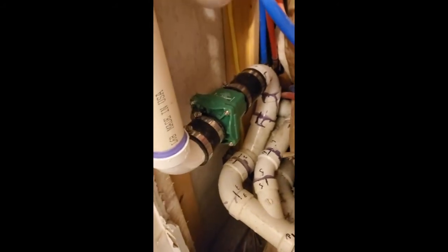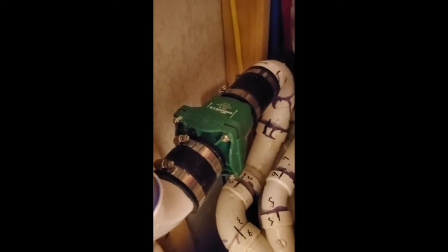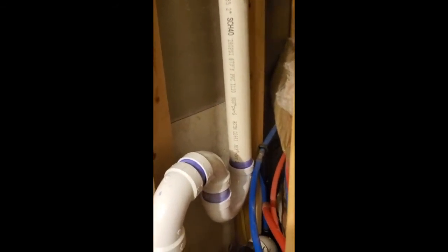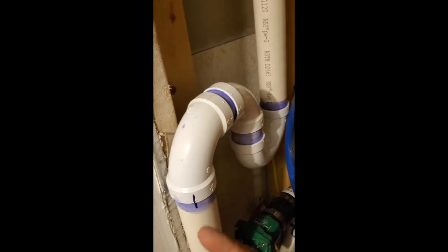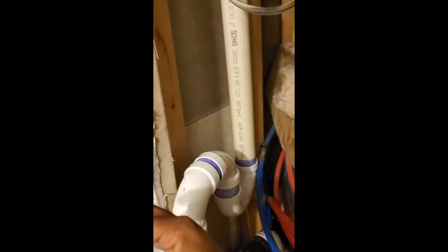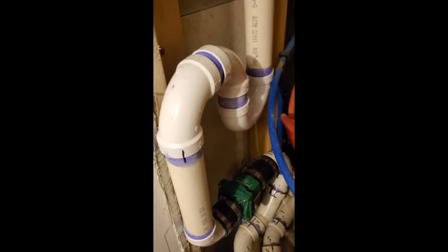Having to clean up sewage flooding your basement — especially a finished basement — is not what you want. That right there is called a backwater valve with a free-swinging check valve. Now I know this is piped up close and it's a tight s-trap, but there's no pressure coming down this line. It's going to be a slow trickle, so there's no force or pressure that would ever break the trap seal. Slow amounts of water from the condensate pump are just going to slowly roll over — it's not like it's coming down a stack with a lot of velocity that could push the water out and break the trap seal. It's just a small trickle, so we're not worried about the trap seal breaking.